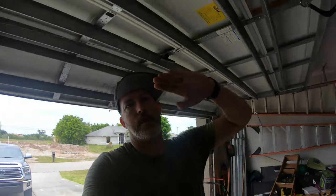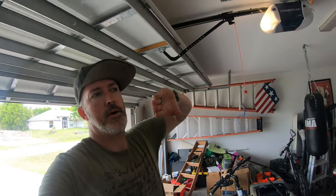But basically you want to put the spline in at an angle and then snap it up. Depending on which way your screen framing is laid out, usually it goes down and then up. Sometimes it goes up and then in, but you put it in at an angle and use your spline tool to push down and in. You'll get it. I have faith in you.